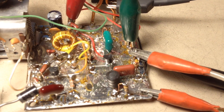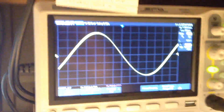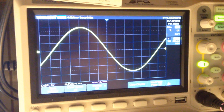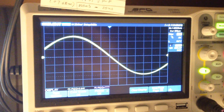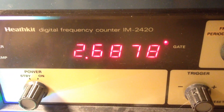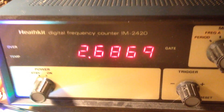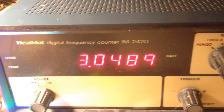There's the circuit tuning capacitor. Here's the output of that circuit. Here I'm turning the physical air variable capacitor — you can see the range is quite large. I'm going from something like 9 MHz all the way down to 2 MHz, which is quite wide for a VFO in this case. I've modified this circuit to give me this range; when it was actually in my rig, the swing was much smaller.